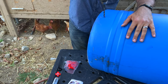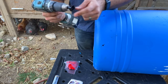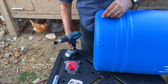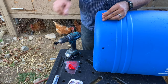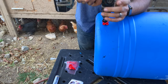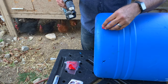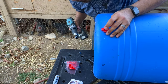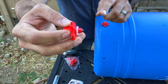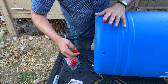First, drill the pilot holes. Then I swap out the drill bit for the little turning tool. Normally you could start a nipple by hand, but this is really hard plastic, so I'm using the tool. After getting it nearly in, I give it one more turn so the little cup at the bottom faces downward and the washer behind it is fully engaged. The nipple comes pre-threaded and has a washer that makes a beautifully tight seal on the barrel.